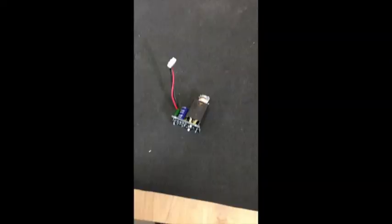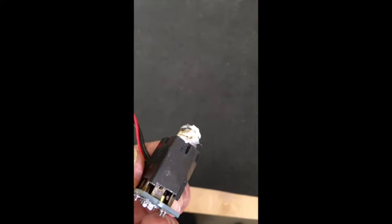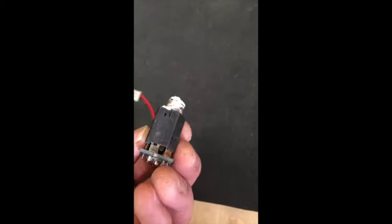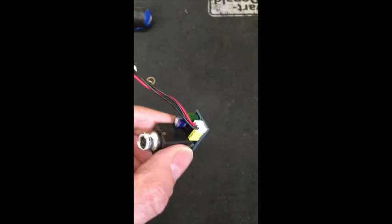With some persuasion, I've gotten the input jack out of there. You can tell someone's had trouble with this in the past — it's all covered in goop and the threads have stripped out. The input jack itself looks like it could be a Switchcraft, or maybe not. At any rate, it is printed circuit board mounted onto this little card. The card has a FET on it, some capacitors, and a connector to take the signal up somewhere else.